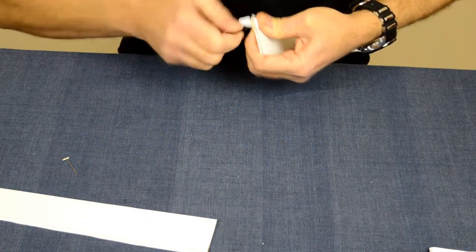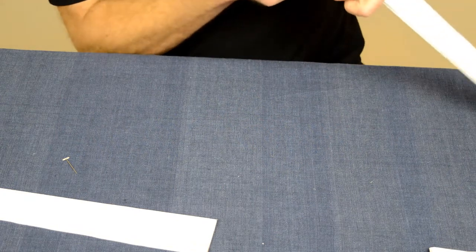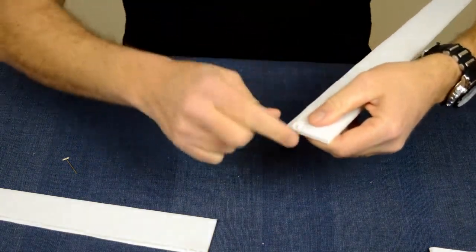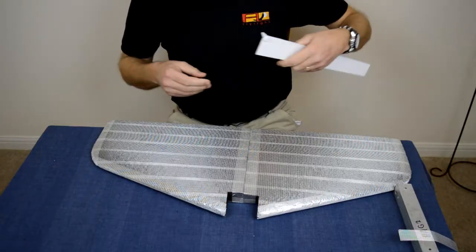There we go. There you go, that's those two just screwed in, and not over screwed. What you don't want to do is over screw these and crush the wood. That's just enough. Look, lovely and firm. And I'll just get on and do the other one.